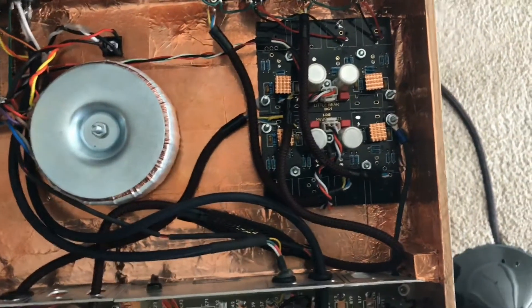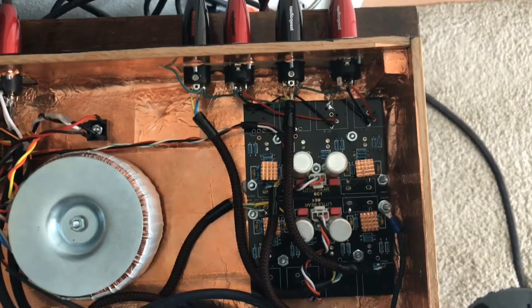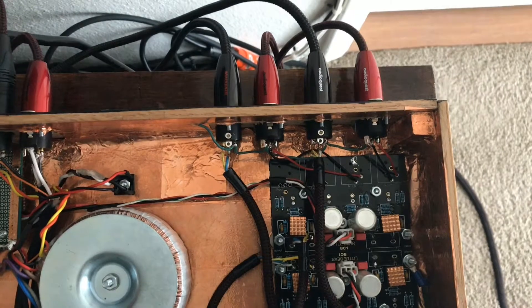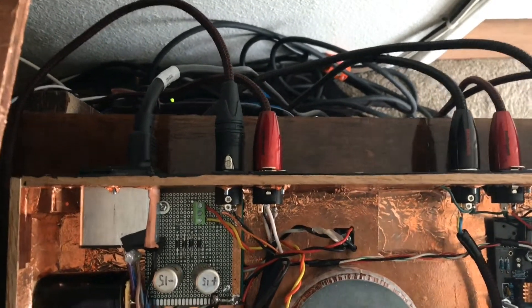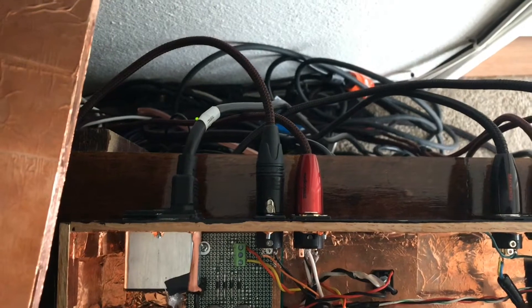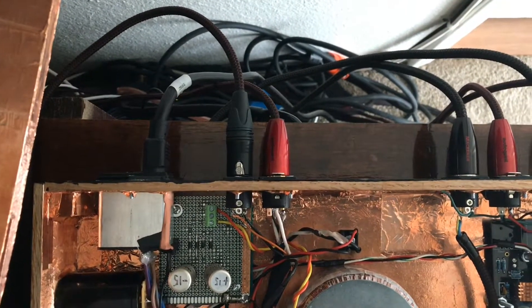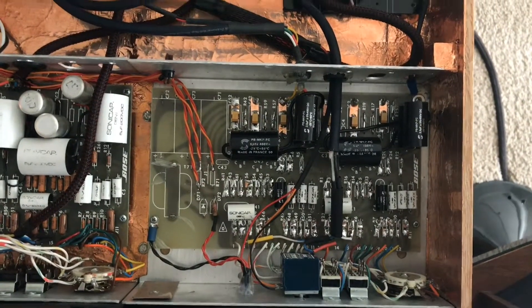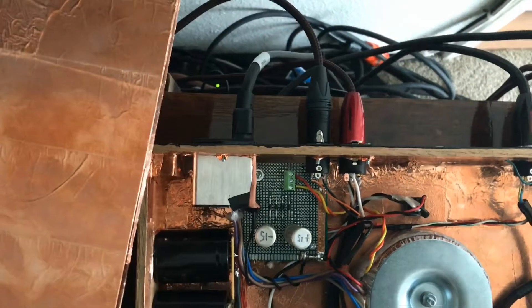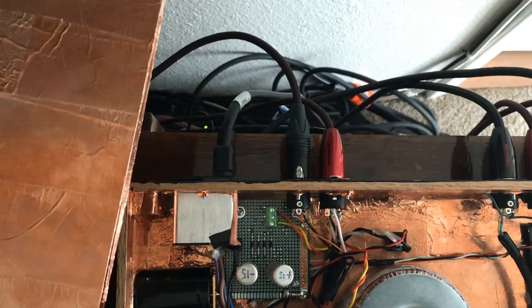You can see my balanced-to-unbalanced-to-balanced boards sitting back there, nice and neatly mirror-imaged, panel-mounted, with a whole bunch of Neutrik XLR connections. You can see my AudioQuest cables there. I had some leftover Red River cable that was RCA terminated, no use for it anymore, and because I had the extra Neutrik connectors male and female from tearing down the original build, I decided to repurpose it - it's got three wires inside: a yellow wire, a blue wire, and a ground. Worked perfectly.